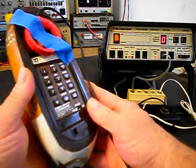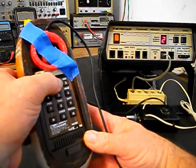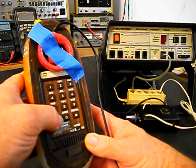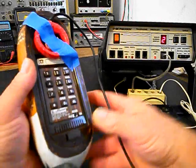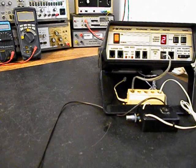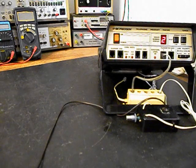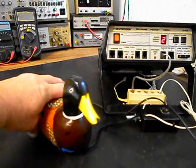We want to go ahead and walk through our numbers. If you watch the analyzer, you'll watch numbers roll by. I'm going to go ahead and end in a 2. Now I want to transmit into the duck telephone. So if you watch this red light on the analyzer, every time you see that red light light up, that's an indication of 100% modulation on transmit. 1, 2, 3, 4, 5, 6. Hello? Hello. Go ahead and hang our duck telephone up.